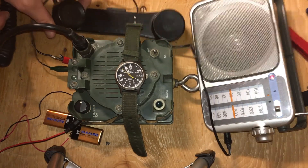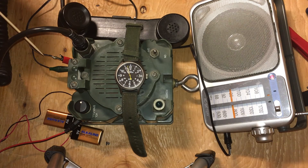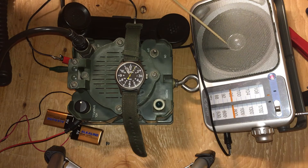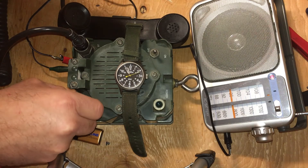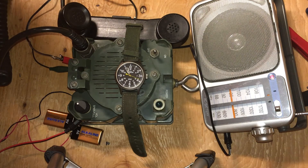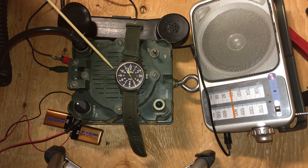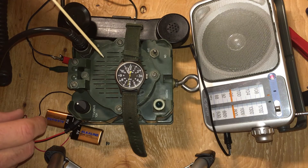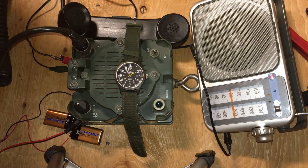The mute works. I haven't tried to key the transmit yet because I haven't isolated the leads going into the radio, and I'm afraid 24 volts might appear there when I key it — I don't want to put 24 volts into a 6 volt radio. That isolation will be addressed in the cable build video. When you put two batteries in series the milliamp hours don't go up, so it's still 350 mAh.